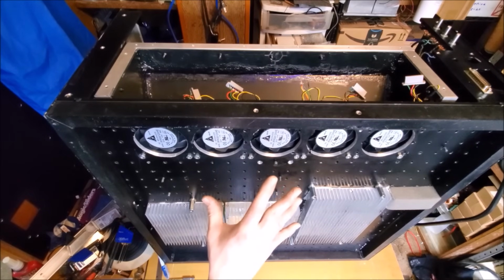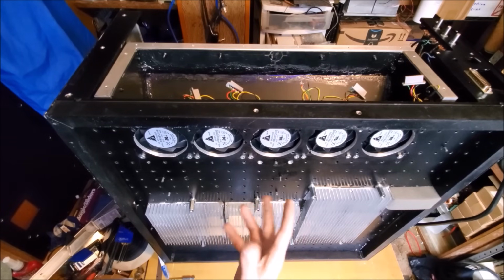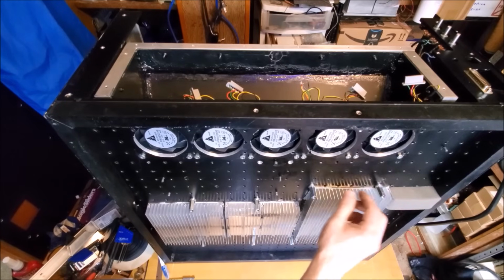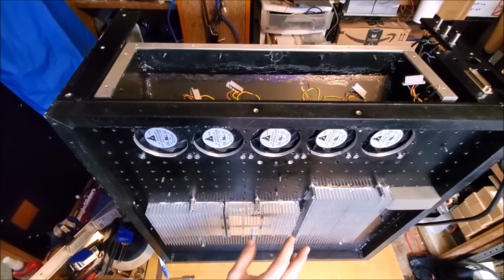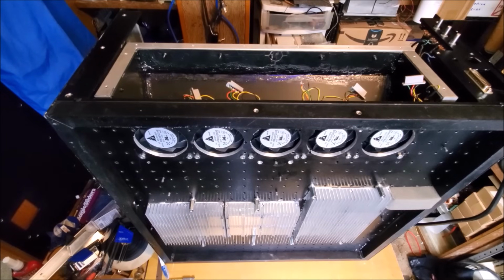The second thing that the plate does will help add rigidity to the optical breadboard so it doesn't bow or sag. Earlier in the video, I installed 8 threaded rods, and those are currently supporting the plate on the inside of the laser that the laser drivers rest on. But in this case, I'm going to do dual duty with those. And on the end of the threaded rods, I installed these appropriately sized standoffs. The standoffs will help hold the plate on the bottom of the laser and will also hold the plate to the optical breadboard, giving us that added rigidity.